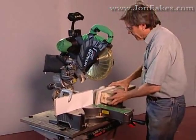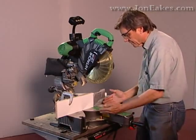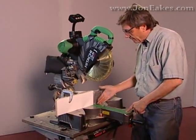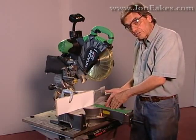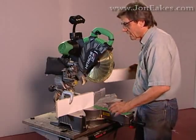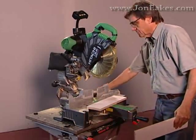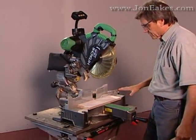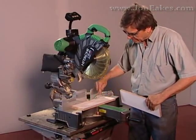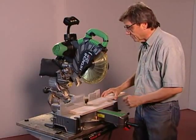The same thing goes for the table — on almost all these saws there's an adjustable sacrificial insert that can be moved in and out, and it should be made fairly tight alongside the blade. When you go to a bevel, it requires a larger space, so you have to move it out or leave it slightly larger. For a really clean job, take a piece that replaces the table and cut right through it. That way you've supported the back side, nothing falls down in, and you don't get any splintering. Sacrificial fences and tables are essential for detailed work and safety when cutting small slices.